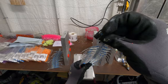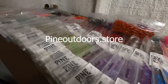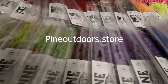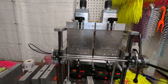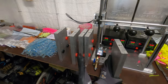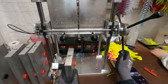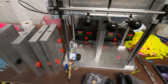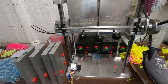There's your beautiful 40-cav from Fat Guys Fishing, full of baits, just made for packaging and shipping. If you're interested in any of these baits, we keep them in stock with lots on the shelf ready to bag — just stop by online at pineoutdoors.store. I only put 32 fluid ounces into the machine on each side, so that's a half gallon. On the fifth set of going through these, somewhere between 800 and 1,000 baits is when the machine will run out of plastic — usually one side has a little more and I have to drain that out generally on the third mold I shoot.